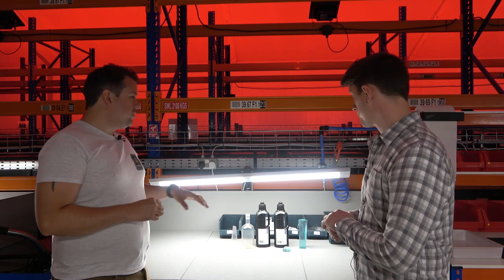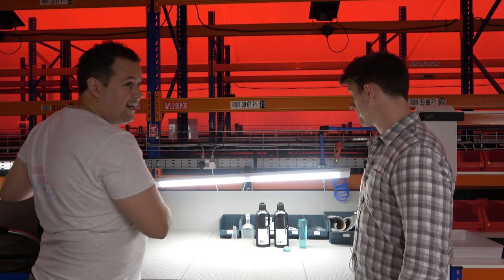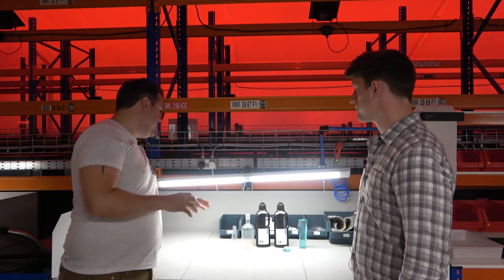They've got two specific materials on show: their crystal clear and their polygloss. They also have additional materials including the durable UV 80, high tensile, and hard materials — suitable for prototyping and in some cases production functional end-use parts. These work on normal domestic UV printers on the 405 nanometre scale, whereas the daylight materials work on 460nm. So these would work in your generic Photon and similar printers.